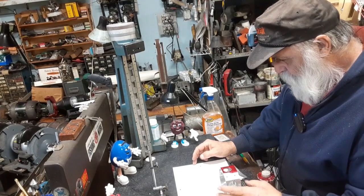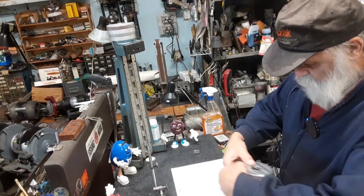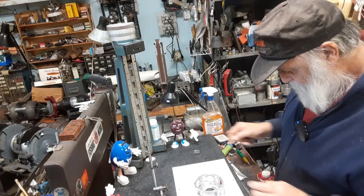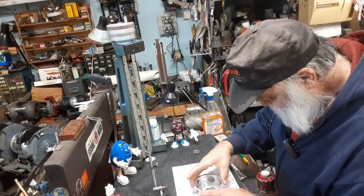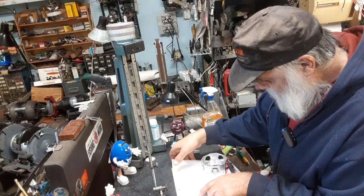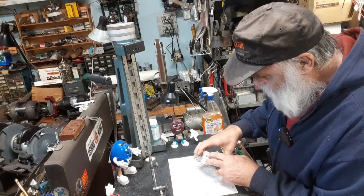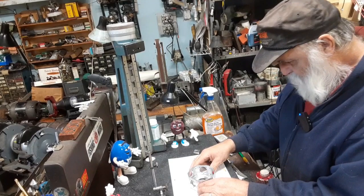So anyway, we're looking at this with a top cylinder, just like that. And we're looking at it this way, though, like that. Correct? Yep. You can tell it's this way if you look right here. There's the hidden line. There's two sizes of hidden lines, small and then a bigger, which corresponds to the smaller mounting holes, 6-32s, and then the bigger hole, a quarter inch. So it's sitting just like that.